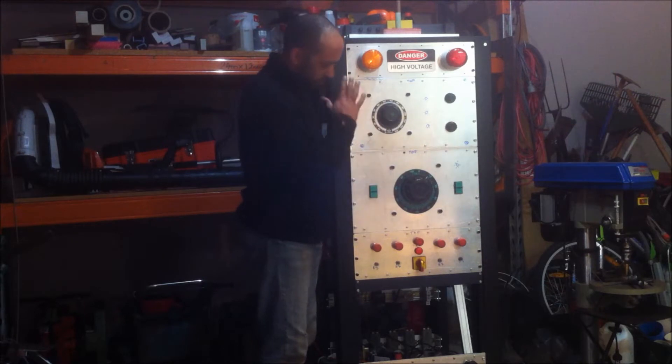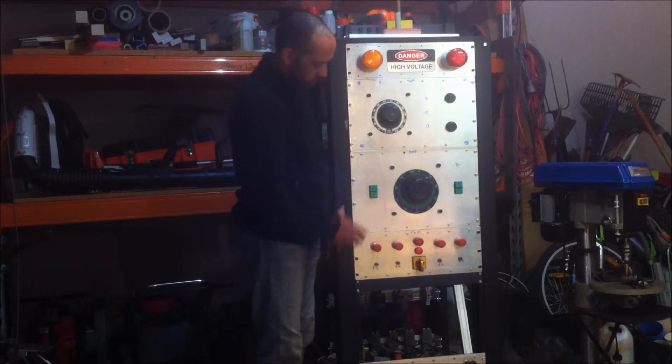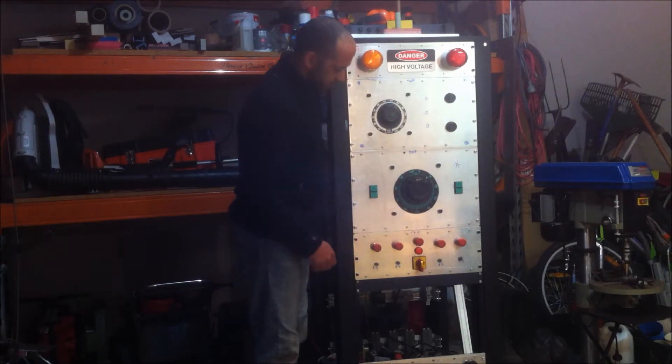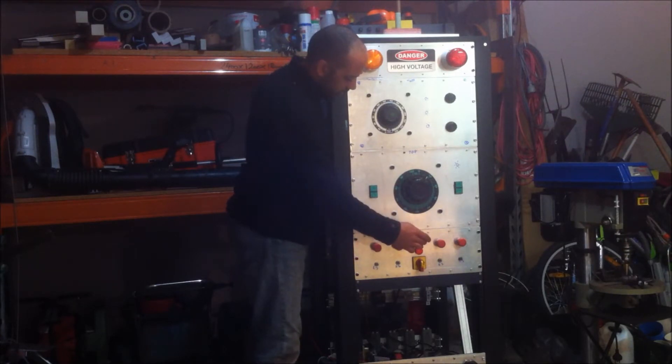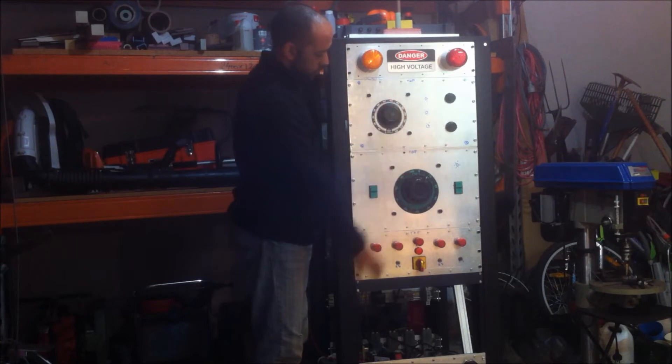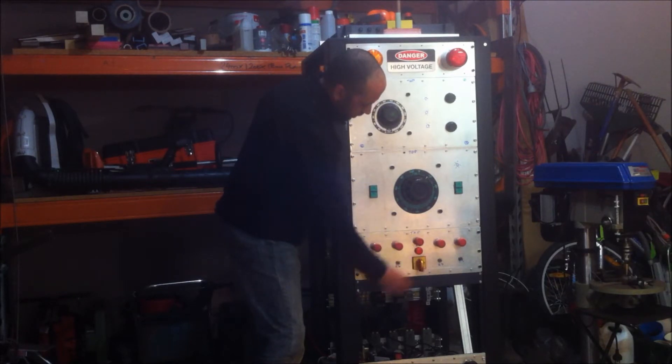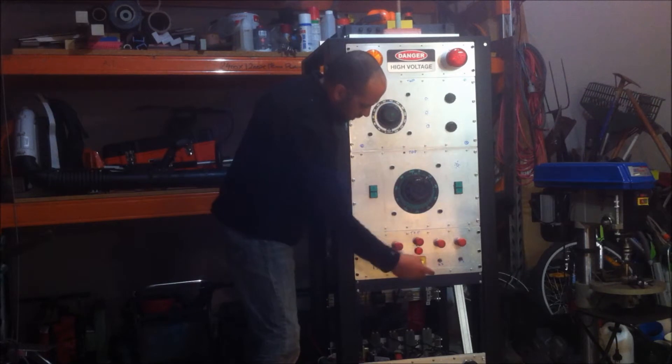In the case that we want to shut down power to the whole rig, I've got the emergency stop button here which will be the emergency stop for the control circuit. I've also got an indicator lamp here for the control circuit, and a main on and off switch for the control circuit which is lockable.